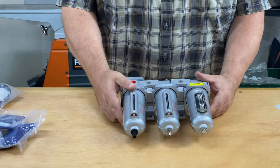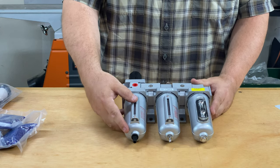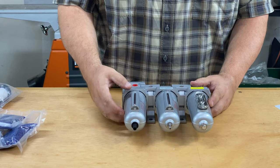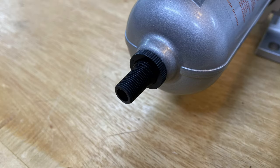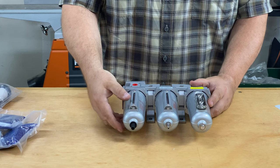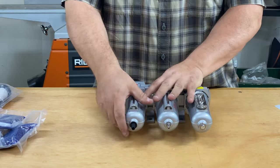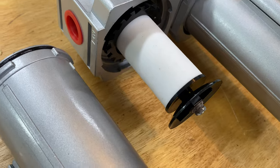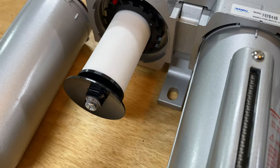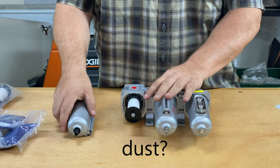The system is a three-stage system. Starting at the bottom, we have a regulator and water trap. This water trap also has an automatic drain feature — the element will rise with the water level and once it reaches a certain height it will automatically drain. Inside the filter you have the element itself for water trapping. This first element traps five microns of dust or water that gets through into your line.